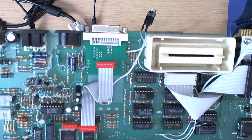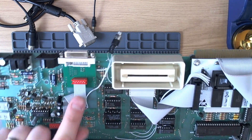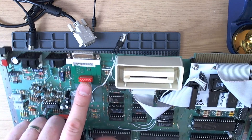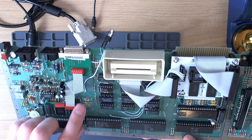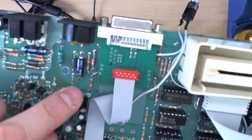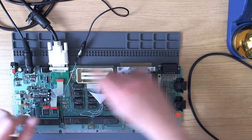I've shortened the ribbon cable going to the Sophia DVI, which was relatively straightforward - you just carefully prise the clip off from either side, then put it in a desk vice. The trick is keeping the cable square with the top connector which has the guides for the ribbon. Top tip: put the top half of the connector over the ribbon cable and then attach it with a piece of tape in the correct position - that will keep things right when it's in the vice. I've done that, and I've attached the audio jack - just run the wire to the front edge of the resistor, which is a direct connection to the audio pin of the monitor jack, and taken ground from the front of the old RF box.